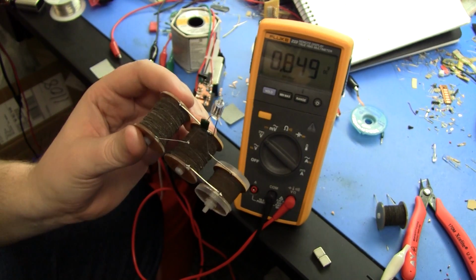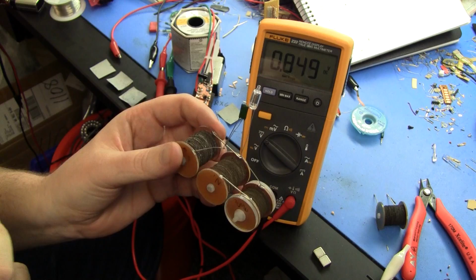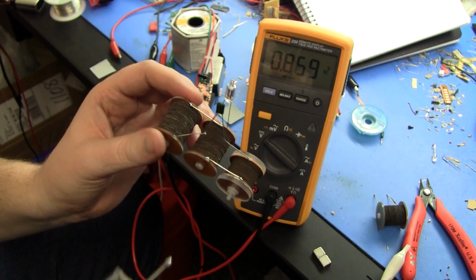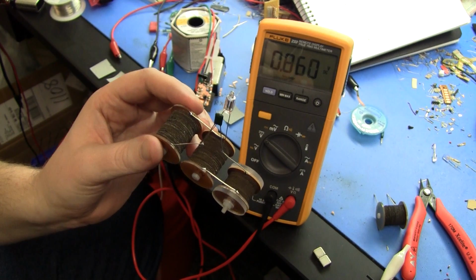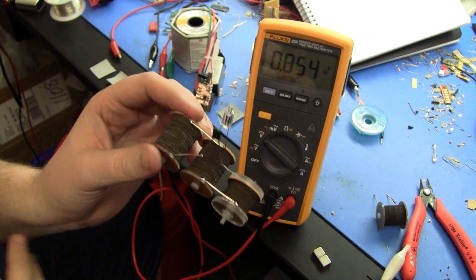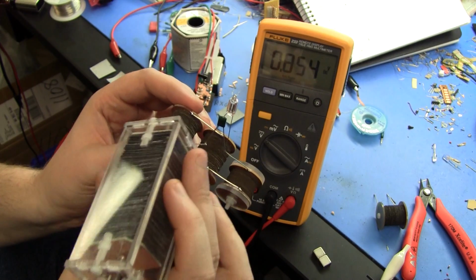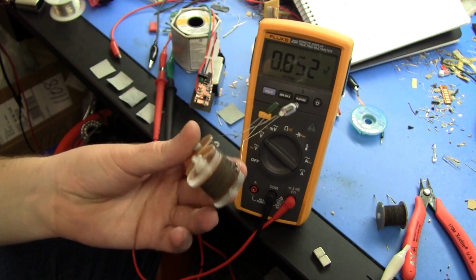I haven't actually put this on the curve tracer yet, but I will put it on the curve tracer and analyze it a bit more. Also, light and dark affects it because, as you know, photoelectric effect. But basically, there's enough leakage that it's dragging down the voltage, and it's never getting to the point where it ionizes and discharges the capacitor. Except occasionally when you touch one side or the other, you'll trigger it. You must just give it enough voltage to start the avalanche despite the leakage. And sometimes you can actually come up and touch it with another dry pile and push it over the edge, which is kind of cool, but not exactly what I wanted.